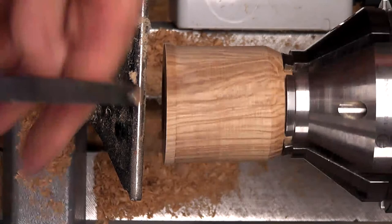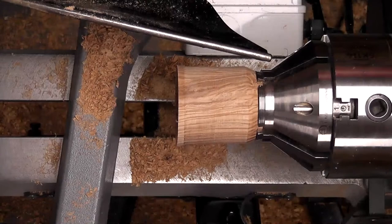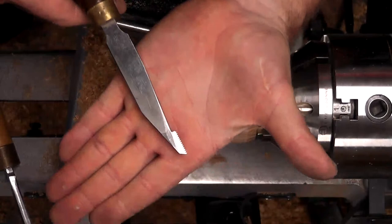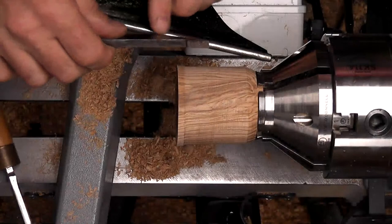We want our arm brace - we'll use this. We've got that hook on the end of it. I'm going to bring the tool rest out and angle it away a little bit - that's given me good access. We need our arm brace, internal chaser - 18 to 20 TPI; I think this is the 20. With quite a fine taper, fine cut for that thread. You can see it's got a little bit of hollow ground on the top - I go to a grinding wheel, hold it, grind a little bit, and then diamond file. So if I want to sharpen it, I'm sharpening the top edge.